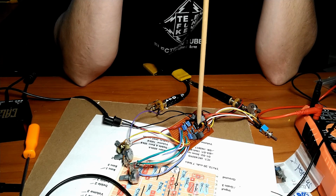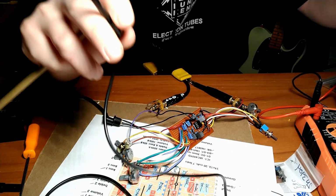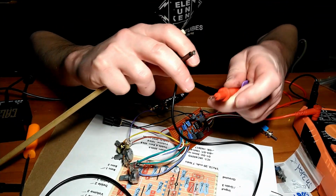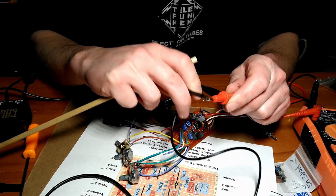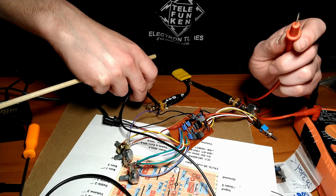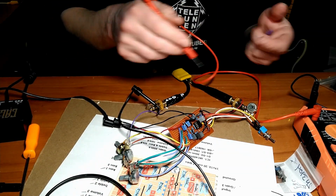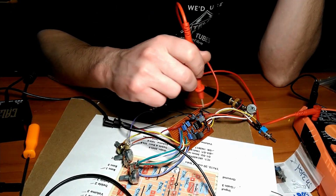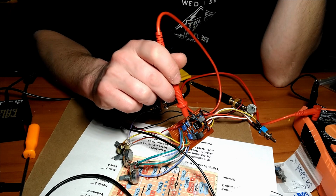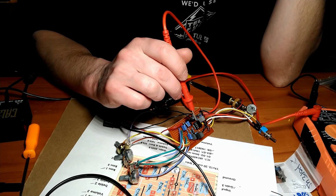But we found the problem with the jumpers, and the way I did that is, get your multimeter out, put it in beep mode for continuity, hook the ground end on one of the negatives of the jack, or wherever you can find ground, and I just probed the circuit, checking to make sure there were grounds where there should be, and to see if there was continuity to ground where there shouldn't be.